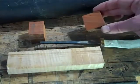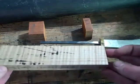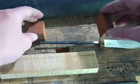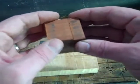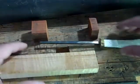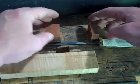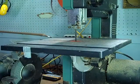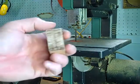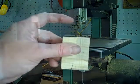I've chosen padauk and curly maple for the handle. I've cut these two pieces and sanded the faces on either side so that they're flat and parallel. I want to get the piece of maple the right length, and to dress up this face I'll return to the sander, sand it flat and parallel with this face.